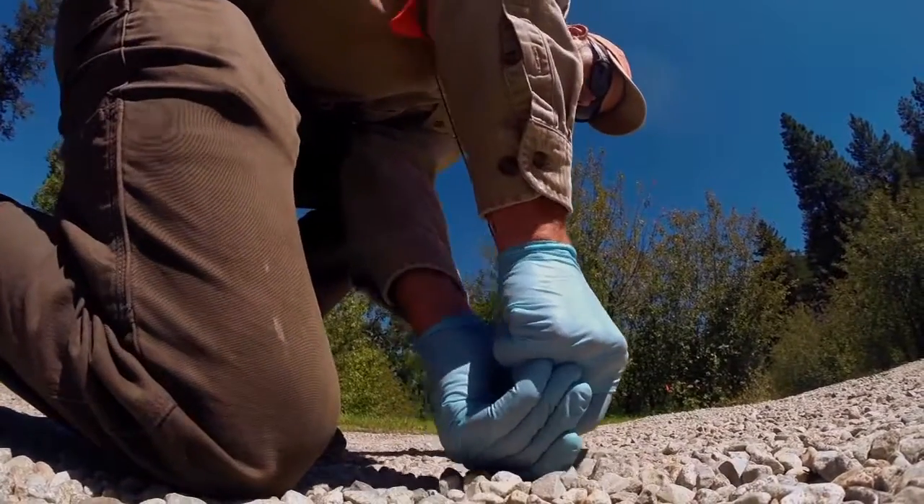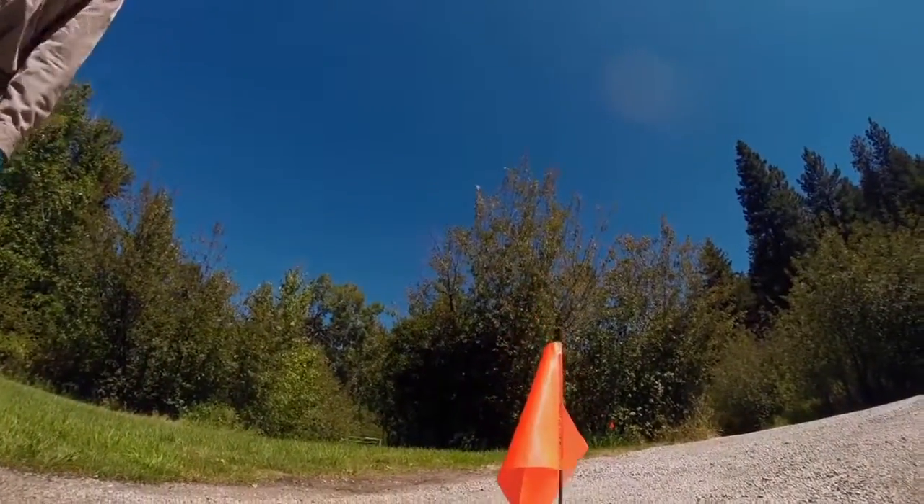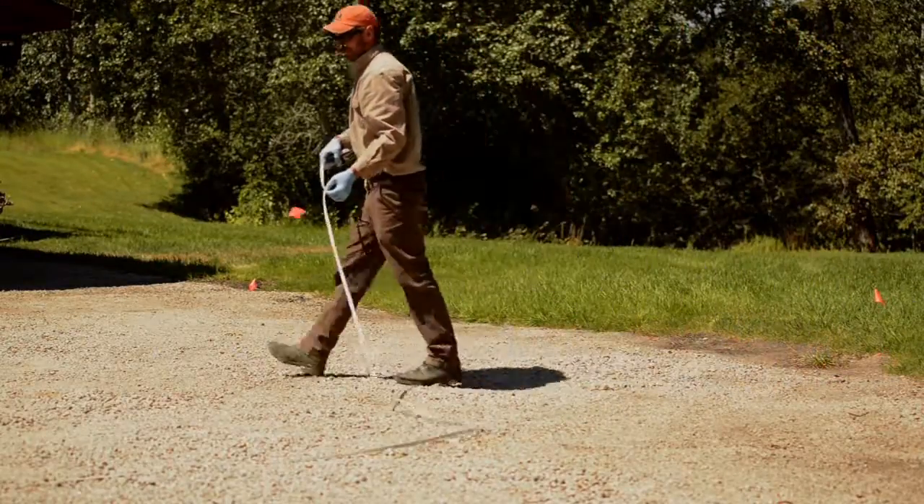So by doing this, if I spray 18 ounces in that 18 and a half foot by 18 and a half foot square, that converts to 18 gallons per acre.